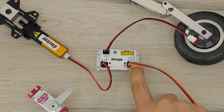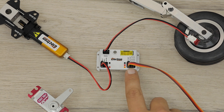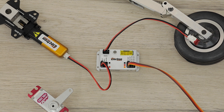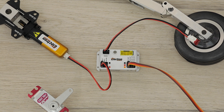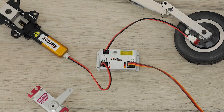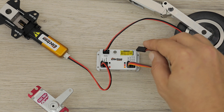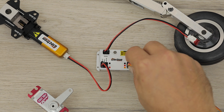The next one is the brake input. If you're using the brake channel we'll connect the wire in here. If you're using single channel mode no connection here is required. For more information on single channel mode please check out our other video in which we go into great detail explaining what it is and how it can be used to your advantage — mainly to avoid the use of an extra channel on your radio or receiver. For this example let's connect it up, following the right polarity.